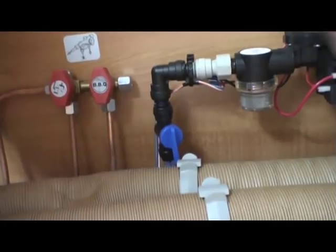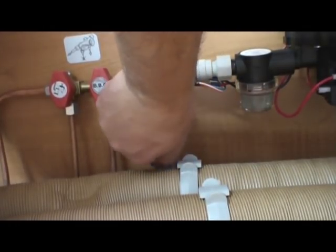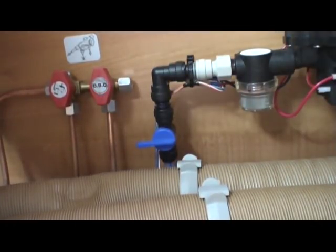So now that we're back in the bedroom again, you may remember that we fitted the shut-off valve beside the pump. Now, that was left in the open position, so for everyday use, water would be able to come from the water tank and through to the water system. We're going to push compressed air into that system, and we don't want that air to go through to the tank, so we need to turn that to the off position.